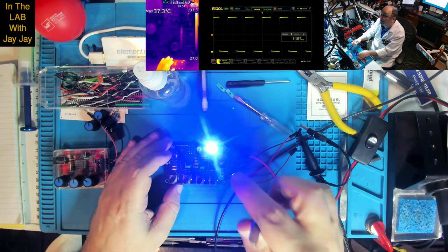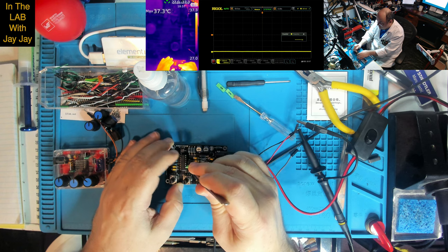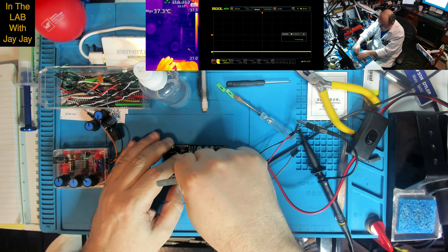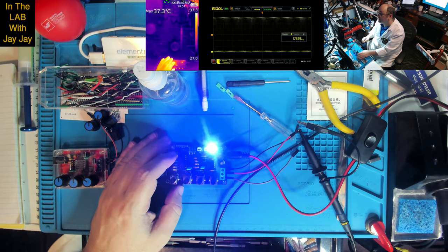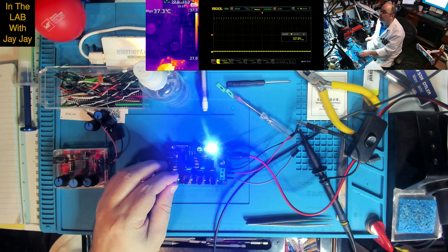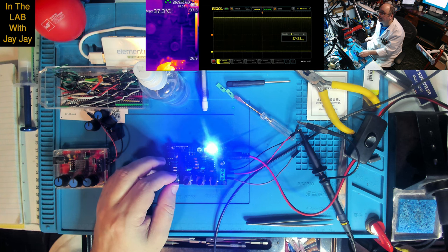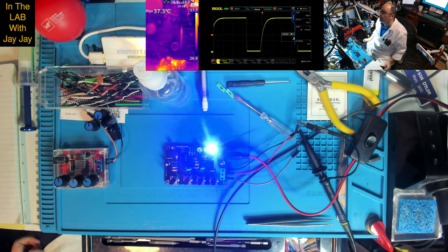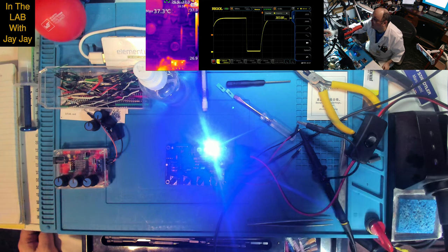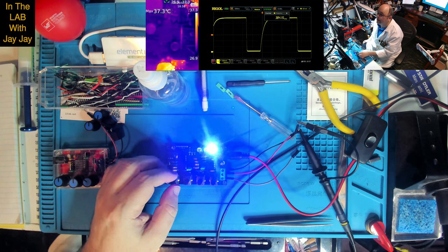changing the frequency. So let's just turn the scope off for a second. And then we'll take our jumper and we'll put him here. Let's see what that does. Okay, that's increased the frequency by the looks of it. Okay, that's the duty cycle, that's the frequency. So if we hit auto, okay, we're looking at, I'll just turn that off. We're looking at nearly 400 kilohertz. Okay, so that's higher